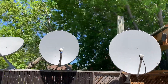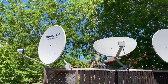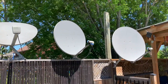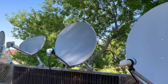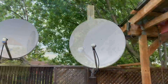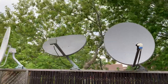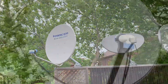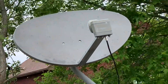Now we'll talk about fixed or stationary satellite dishes. Generally speaking, with a fixed or stationary satellite dish, you're fixing it on one satellite per dish. So if you wanted to capture three satellites, you're going to need three dishes. The only way to capture more than one satellite with a single dish would be some kind of multi-LNB setup, like on a Shaw dish or a bracket that you can mount multiple LNBs to.